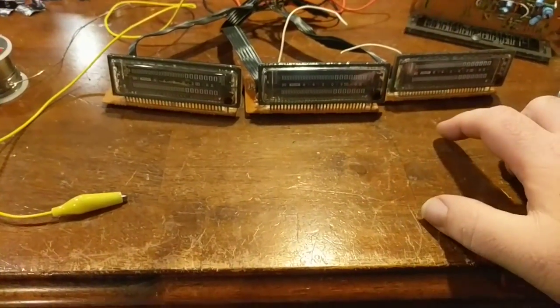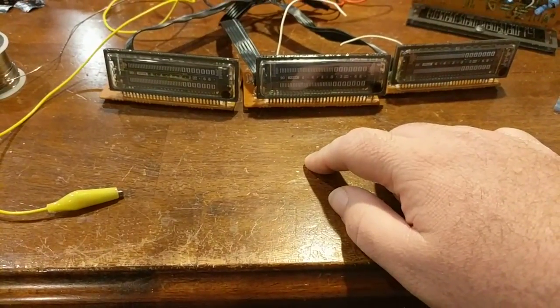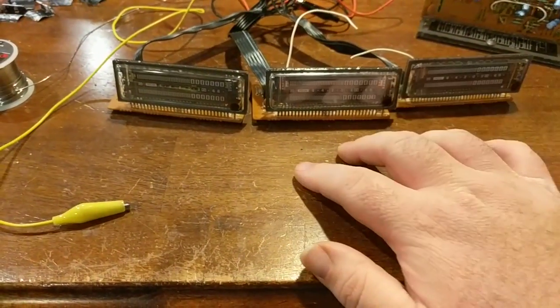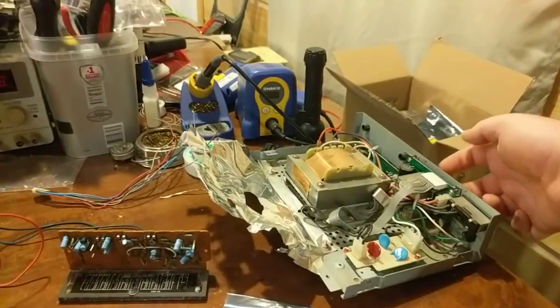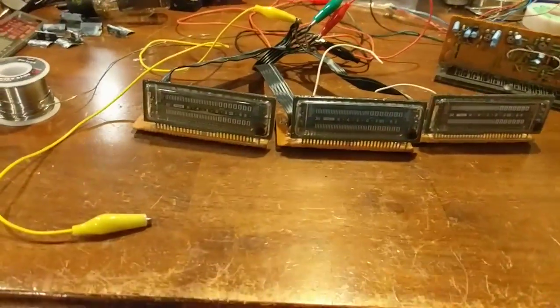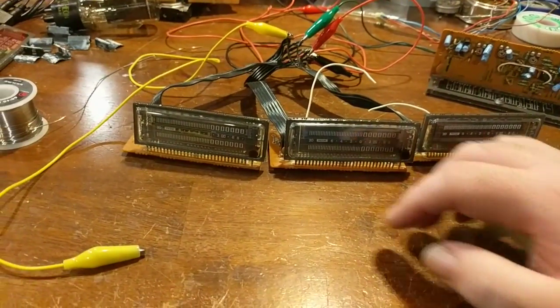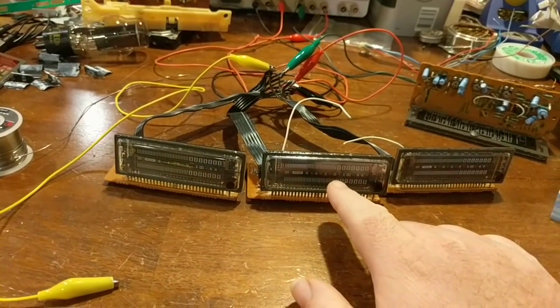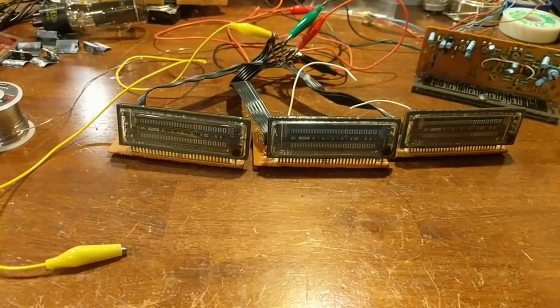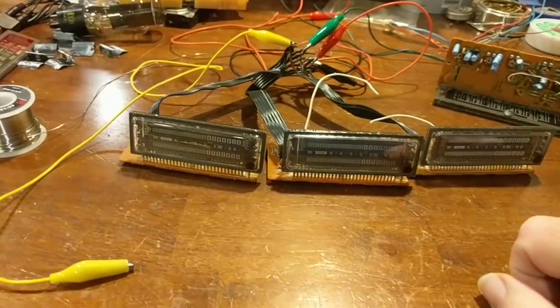So you'll have that, and then that line level output will go into a circuit board, which will have an op-amp buffer. The buffer will go to the RCA jacks on the output of this thing. There'll be RCA jacks back here, and it'll go out to the stereo. At the same time, it will also go into the Class D amplifier, and then it'll also go into another buffer with gain to drive this. The cool thing about that is that it will isolate the DAC from all the other outputs.